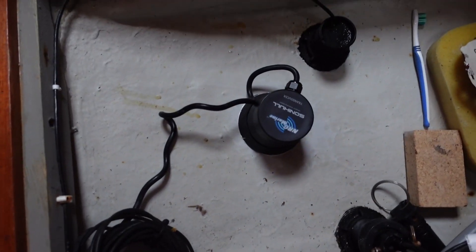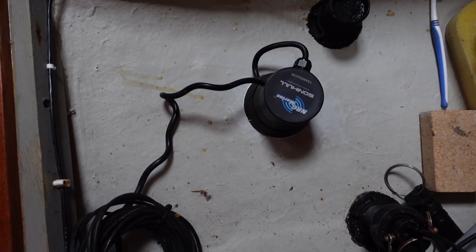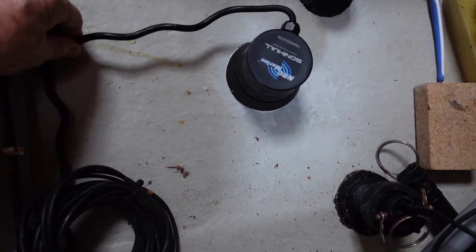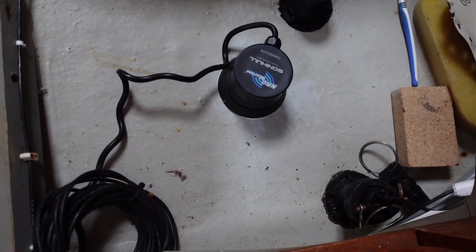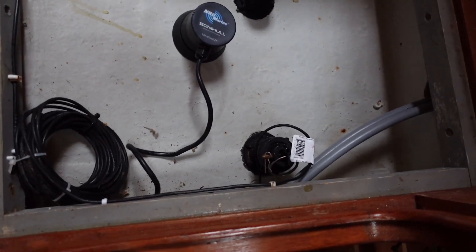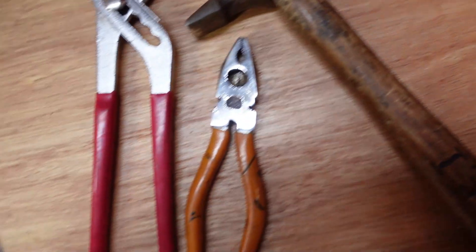There's the transducer in, aluminium plate underneath it, glued to the inside of the hull. Just need to tidy up the wiring, then we can cover that back up again. The last few days have been spent groveling around in the bilges, under the lockers and things, running cable.